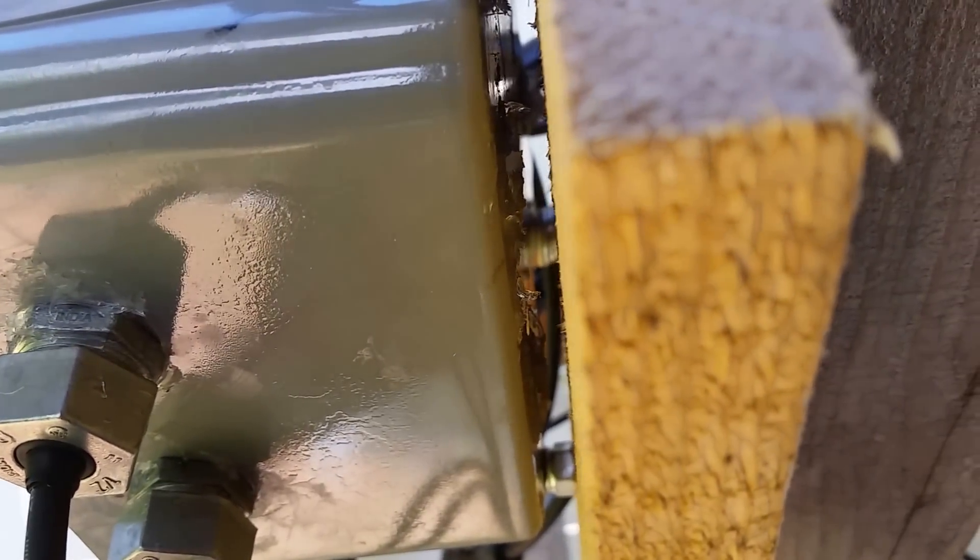So I bolted them in, bolted them to the plastic, offset from the block. And I covered the back of the screw heads with just a giant glob of silicone so nothing can short out across the back. I'm not worried about anything getting in there to do that. I wanted these buses bolted in hard and fast.